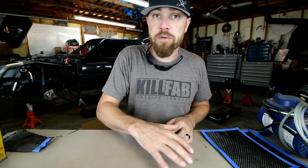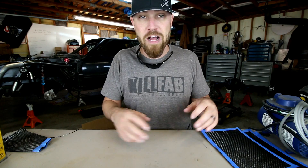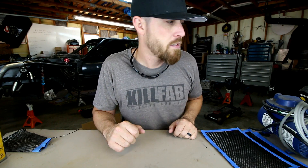When doing a wet layup on carbon fiber with an epoxy resin, the best way to do it is a vacuum bagging process, which compresses all the layers of carbon fiber and sucks out any extra resin that's not needed. If you're using carbon fiber, you want strength and you want it to be lightweight. Vacuum bagging helps you acquire both of those things: strength and lightness.